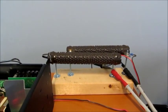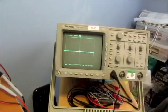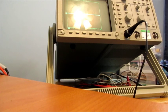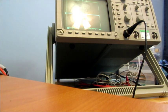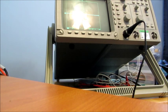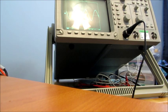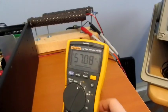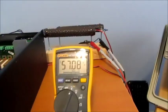So what I'm going to do now is load test this thing. I have my 8-ohm 600-watt load connected here. It's two 4-ohm resistors, 300 watts apiece, total power. And I've got my scope and my DVM. So just give me a second, and I'm going to slowly bring up a 315 hertz sine wave. So there's my sine wave, and I have 57.1 volts AC on the output, and I'm not hitting clipping,